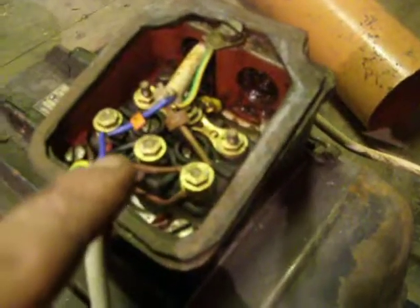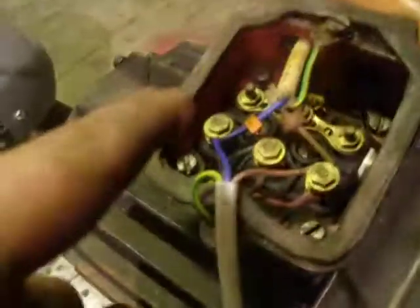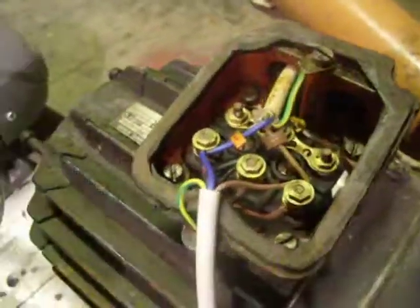There you are folks, very simple. What I've done is I've just set a live off, live onto L1, live 2 off the one I'm not using onto L2, and then the earth — or the ground, which is a neutral — goes off L3, back to the neutral. So technically I'm doing the same thing, partly I'm just using the extra phase.